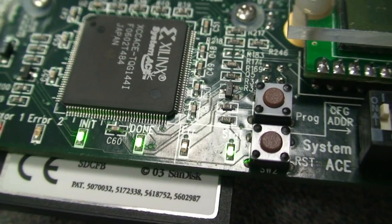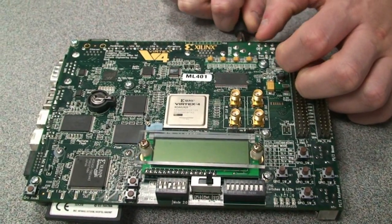The FPGA itself has a mechanism that allows us to remotely flash it from a compact flash card, as well as a self-flashing mechanism for recovering from bad flashes and power outages. One of the key points of our robot is that if the battery does go dead and we need to sleep overnight, we have a self-recovery mechanism known as Lazarus. The FPGA itself can use the power from this to reflash itself, as we're going to demonstrate.